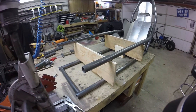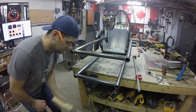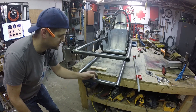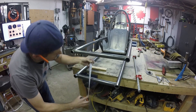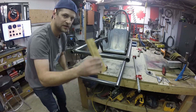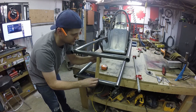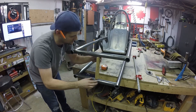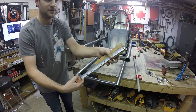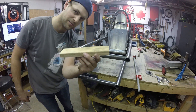Again, I'm not actually racing with this, so it doesn't really matter. Another thing I use wood for a lot instead of a measuring tape — for instance, I want to put a pipe in here to connect these two together. You're trying to measure that and eyeball it; it's not so easy. So I just find a scrap piece of wood, cut it down to the right size with my chop saw until it fits nice. Then I can either get my measurement from that, or I can just use this to mark right on the bar and cut it to that — and it'll fit perfectly.